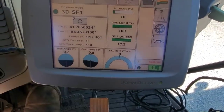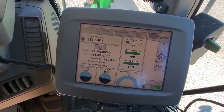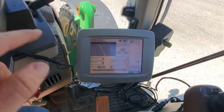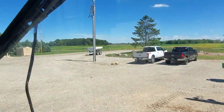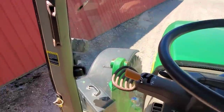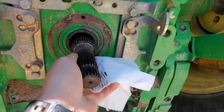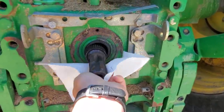That's our Starfire — everything's there and good. We need to calibrate because we're way off on our pitch and roll, but we can do that. One more thing before we hook up to our spreader: we need to switch our PTO shift because it's a 540 RPM PTO and we've got the 1,000 in from the mower. Going to swap that real quick — basically you pull the snap ring out, pull this out, flip it around, put it back in, put the snap ring back in.